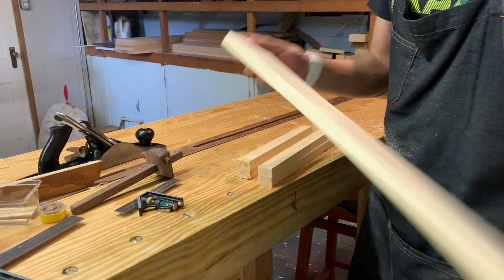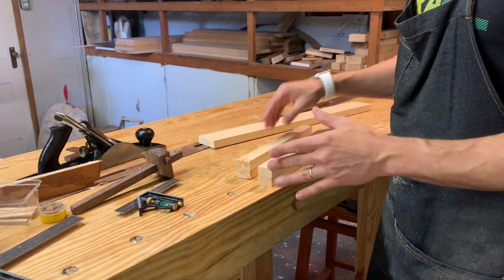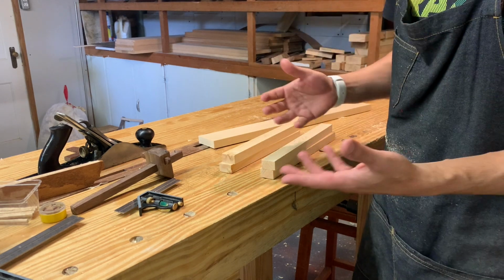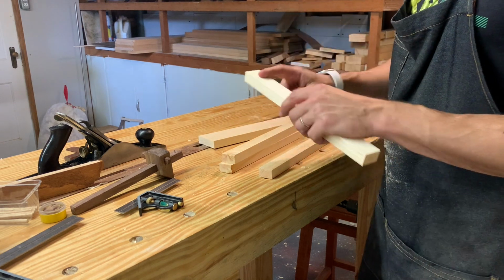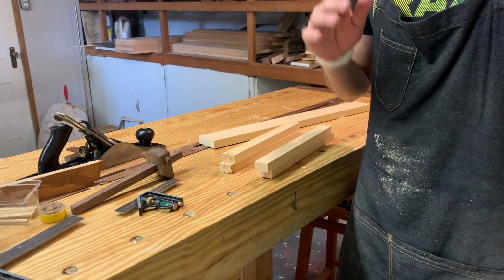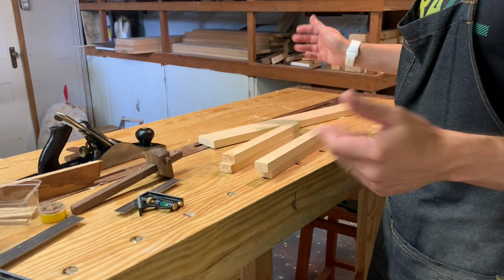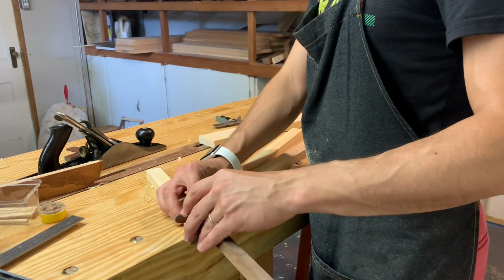And this one I cleaned up both ends because essentially I can make a tenon on each and then cut it. I can form 1 tenon on each of these, and then when everything's dry, I can assemble it, then insert the tenon into the back, and then just measure off to the front. I can get all the tenons inserted into the back, which has already dried for 2 days now. So I'm going to mark off the distance